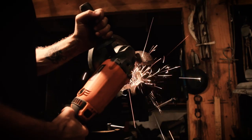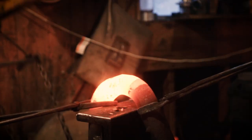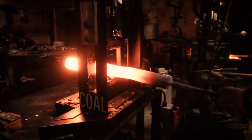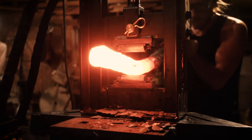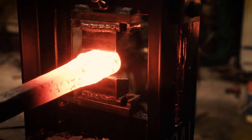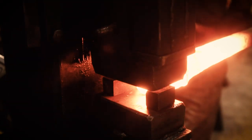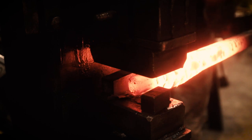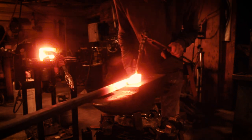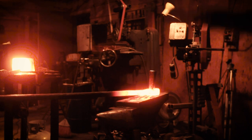While Ryan continued processing the first piece, I took a little more meat off the second link and made some scalloped cuts into the bend, which made straightening easier. Then I blasted some weld into the cuts while the steel was still hot and added a handle for maneuvering. Using a combination of the draw dies and some planishing using the Little Giant, I was able to get a nice long taper for our shank, leaving a bit of mass at the top and bottom. I used the butcher dies again to shoulder in the bottom for a tenon, and then evened it out using kiss blocks on Ryan's press. As for the top, we decided to challenge ourselves by punching a square hole for the stock.